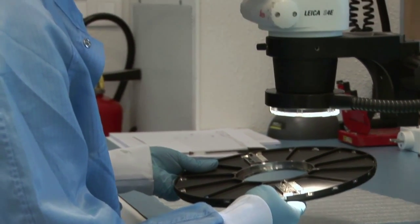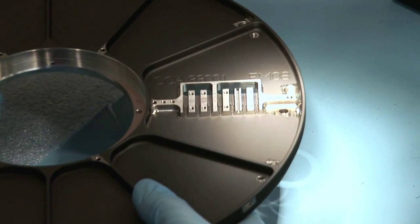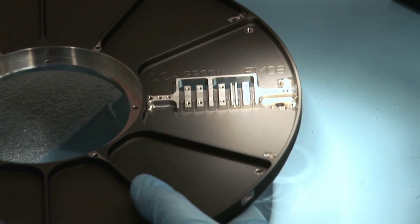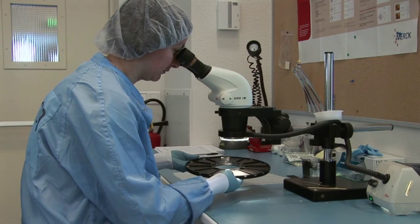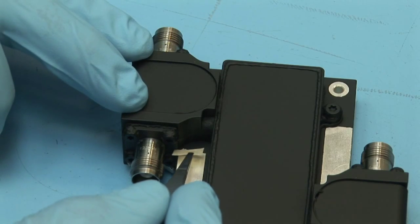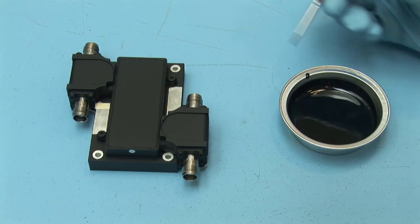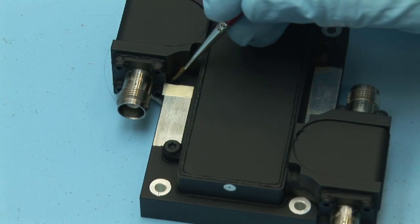On hardware: visual aspect. Verify that there is no crack, run-out, agglomerate, or lack of paint. Verification of unmasking — a self-checking will be done on masked areas. If a lack of paint is detected, lower than 10% of total surface, a repair could be done within the frame of the defined repairing process.